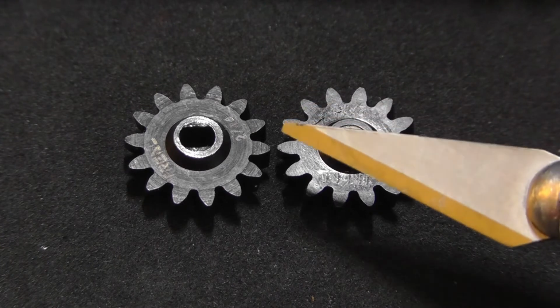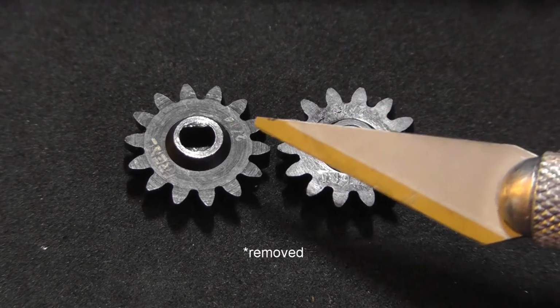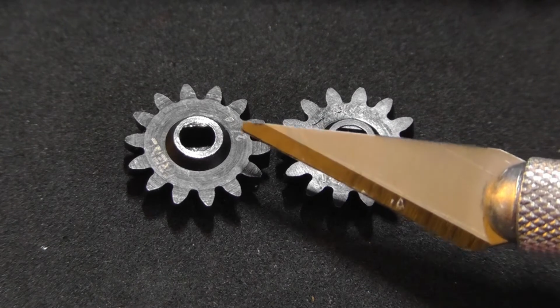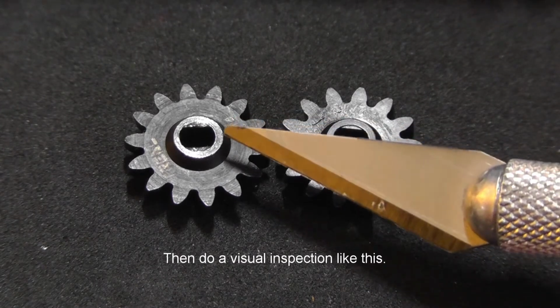I will add that you have to make sure that your wheels are disconnected, because a lot of guys have a tendency to over tighten the wheels, and that will cause a funky binding issue on its own. So remember, take your wheels off if you want to verify whether or not you've got a problem related to this gear.